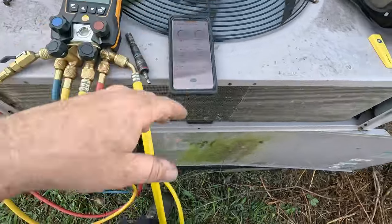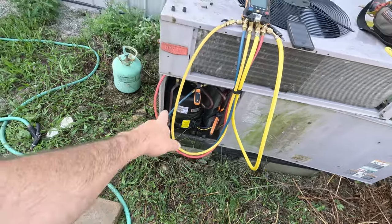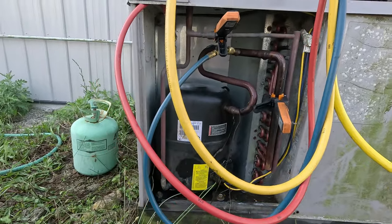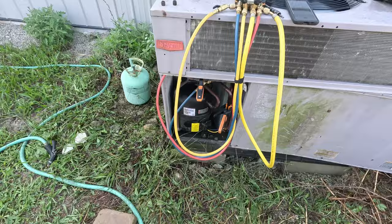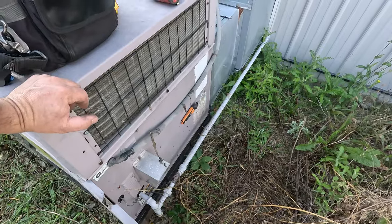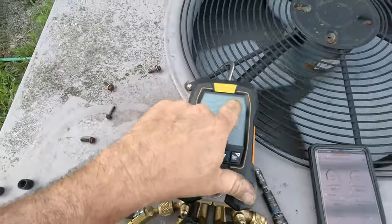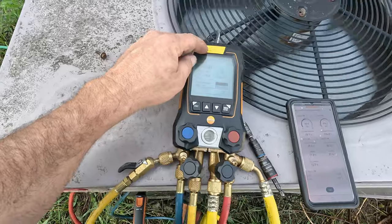We are doing it off the discharge, which you're supposed to do off the liquid line — but the liquid line is probably hidden somewhere back in there. It's got a Bristol compressor in there. We know they aren't reliable — surprisingly, it's still running. As far as discharge temperature, we've got our other sensor down there. You can see up here that we have four Bluetooths connected plus a phone. All my test stuff can be had at True Tech Tools, promo code 'survival' for 8% off.